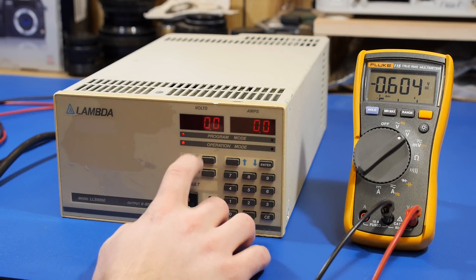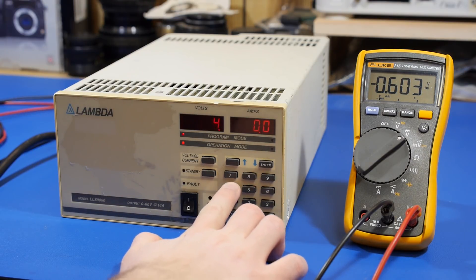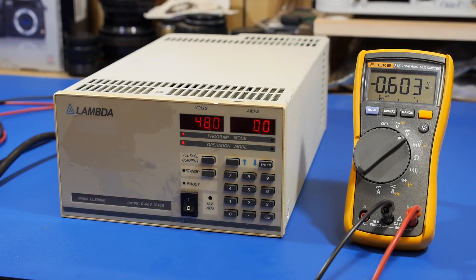There's also an overvoltage adjustment for tweaking the power supply toward its maximum range. For example, I'm in constant voltage mode and I want 48 volts, so I can just hit enter and it should give me an output of 48 volts. But as you can see, the output is 0 volts, and according to my meter it's negative 0.6 volts — so there's clearly something awry. I have the output terminals correct; V-plus and V-minus are appropriate, so there's clearly something wrong with the power supply.